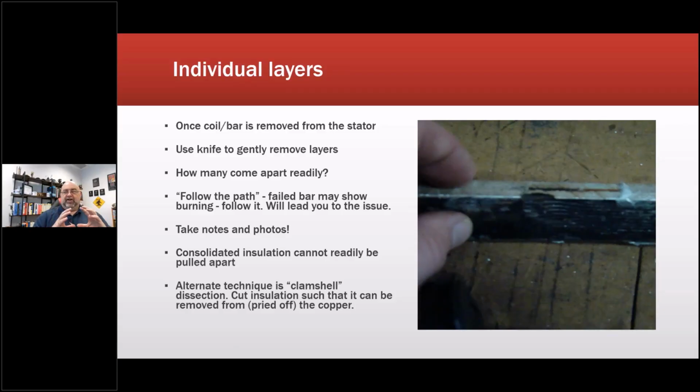So if I have a failure in a winding and it's a cavern, meaning that I have an opening towards the outside and all this area in the middle is open, well, that's because a winding short occurs as plasma, which is a perfect void, perfect circle, a perfect globe. Well, the physical properties of the material are going to make it not a physical globe. But if I look at it and I figure the geometry, I can figure out the center of that geometry, and that's where the failure occurred.